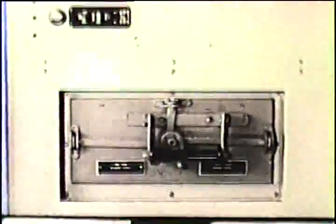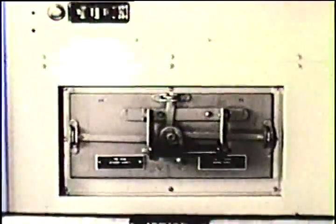Make similar checks at the power panel on the starboard side. This supplies power to the other lubricating oil pump and to the other saltwater circulating pump. Get the power to the auxiliaries and they will almost always go. If they do not, use the standby equipment and look for the trouble. Standby exciter fails to start.